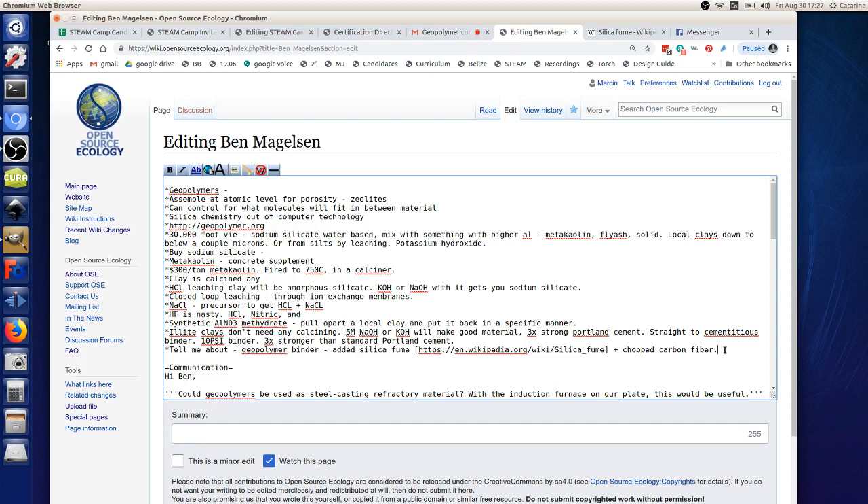What about getting to steel temperatures? One application that might be a good project is finding a crucible that's easy to make — either machine or cast — and combining that with 3D printing. One thing I think has great potential for DIY manufacturing is what I call MIG casting: using a crucible of a shaped form and using your MIG welder simply to deposit the metal.